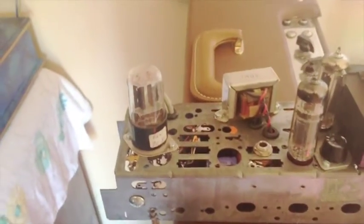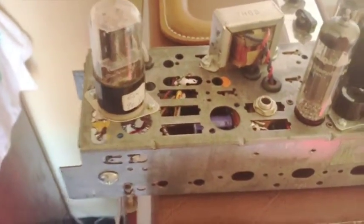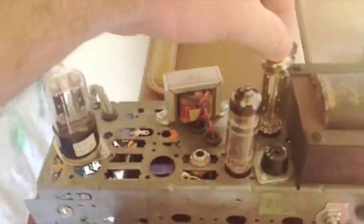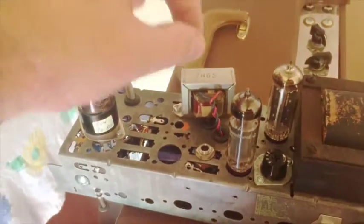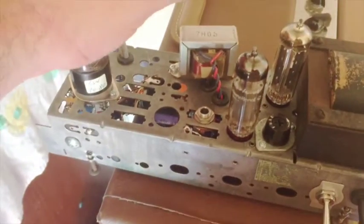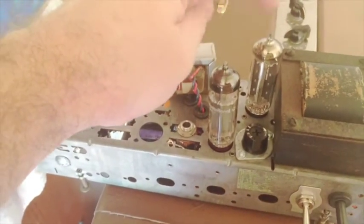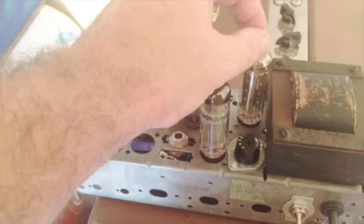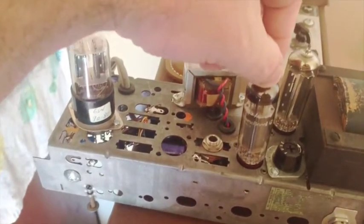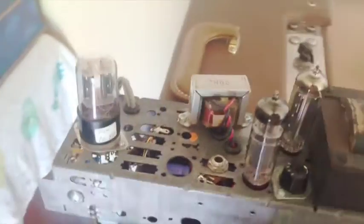This is an Australian Philips radio from 1955. It originally had the AM section with the typical valves you get in an AM radio — a superhet with a 455 kHz IF. It had a 6V4 or EZ80 rectifier valve and a 6M5 output valve. Both were really hard to source, so I substituted a 6CA4 rectifier, also known as an EZ81, and an EL84 or 6BQ5 as the output valve.